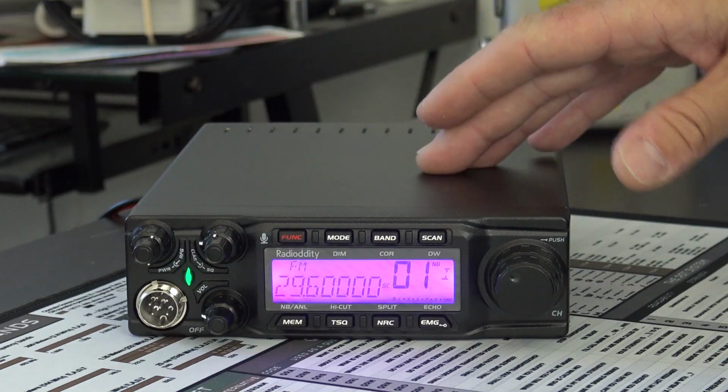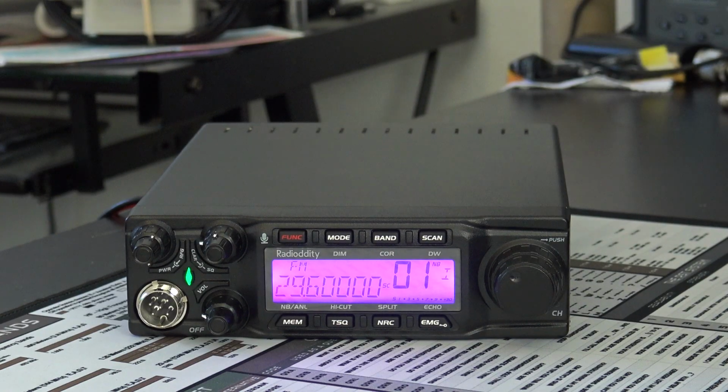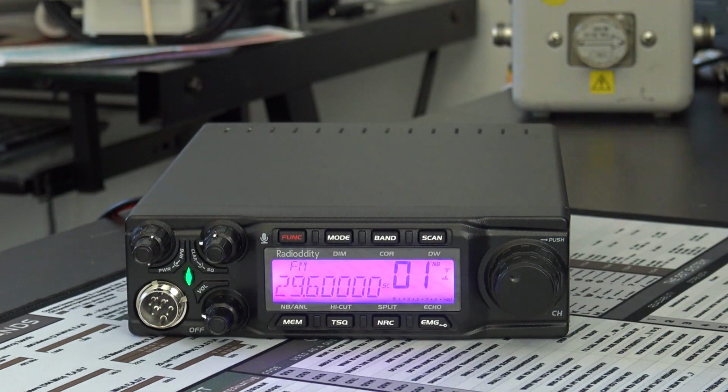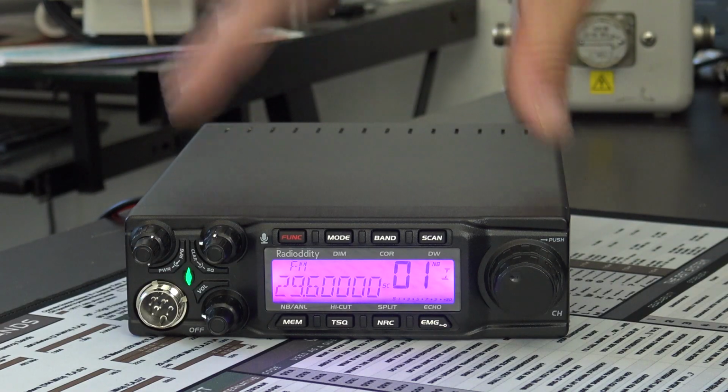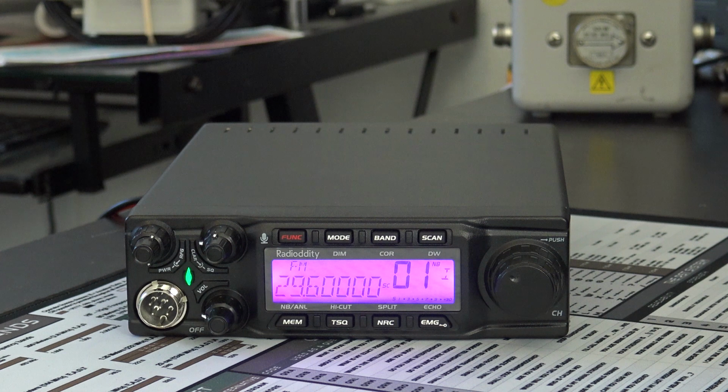We're going to check this out because this is new. And I will give a disclaimer here. I got my Bird 43. I did some power measurements. I'm going to use my COM120B IFR service monitor to do frequency accuracy and power, because this is an 80 watt QT80. It's an 80 watt PEP maximum 10-meter transceiver.